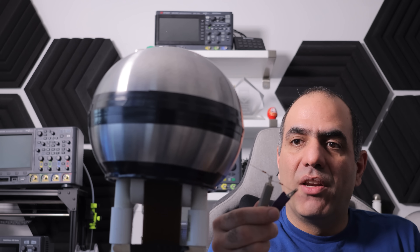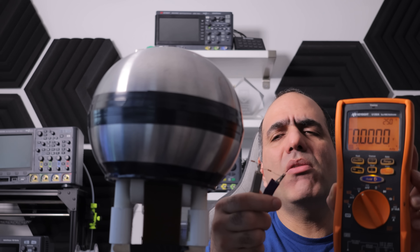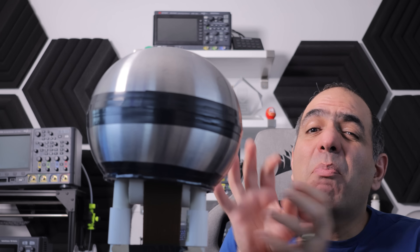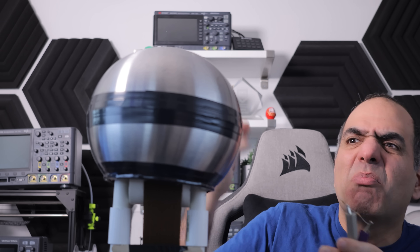The voltage will go over the resistor divider and... zero volts? It's impossible. Something's broken here. The issue is the voltage builds up high on the Van de Graaff as the charge is being pumped on it at a slow rate. These resistors, although they are in the hundreds of kilo-ohm range, suck charges much faster than it can replenish them, so the voltage drops to almost zero. This is an important point: every time we are measuring anything in the universe, we are taking a sample of it to look at, and that action changes the levels we are trying to measure and causes inaccuracy. We have to keep that in mind and minimize the measurement impact.